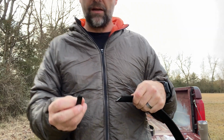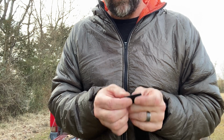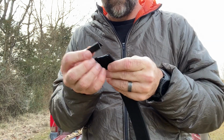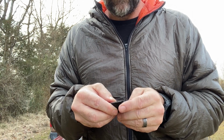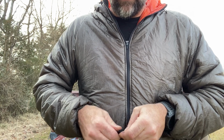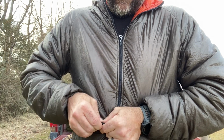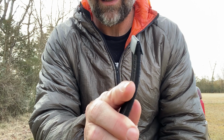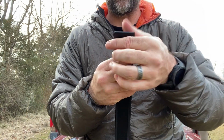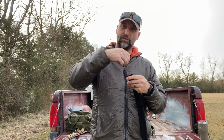And the kit comes with this right here that you clamp onto the cut end. A little piece of metal, little belt end. You're gonna put this on and smash it down to clamp onto the end of this belt. So you can bend it a little bit by hand and get it started so that it stays on there, but you're gonna need to use some sort of tool, whether you use a hammering tool or a squeezing tool, something like that, and smash this down.